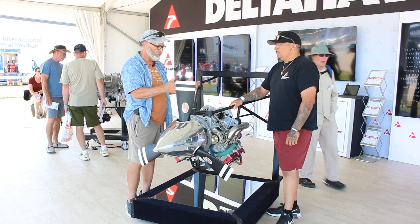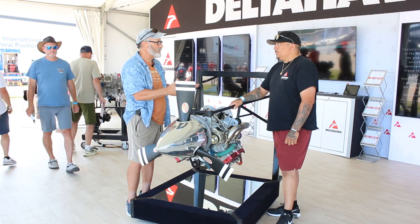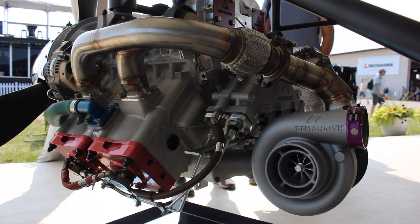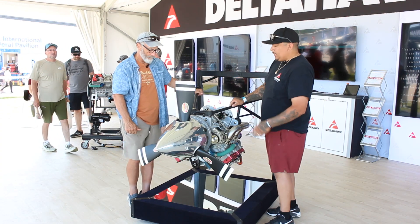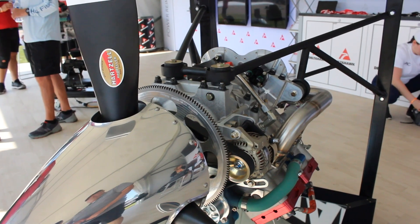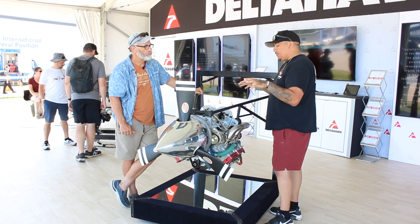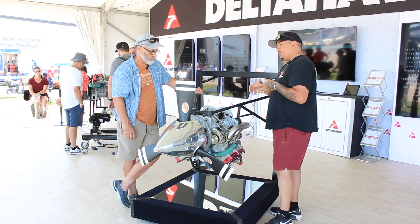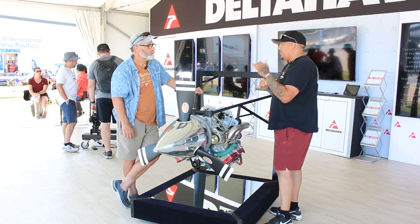Could you tell us a little bit about the history of this engine, what the base is, what kind of engine it is and why we're talking about a Delta Hawk in this two-cycle, two-stroke diesel configuration? Delta Hawk is a two-stroke 180 horsepower. We do have a 200 and a 235. The interesting thing is they're all the same engine, same footprint. With it being compression ignition and direct injection, all you have to do is tweak timing, increase the boost, and you get more horsepower. That's why people see that similarity between weights and everything.